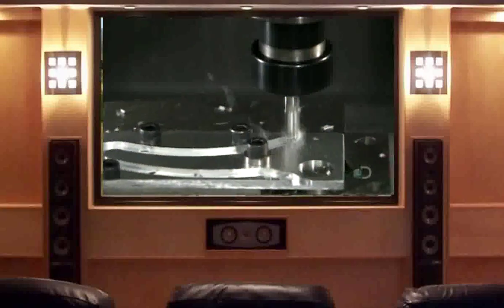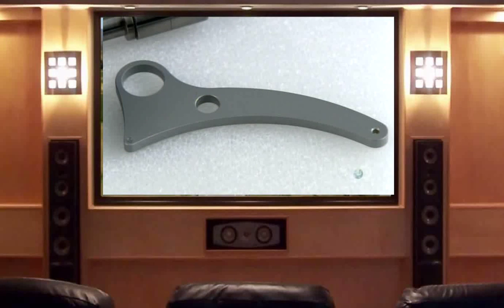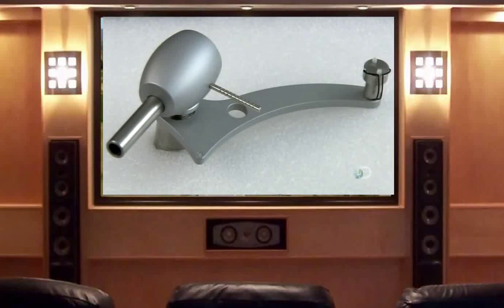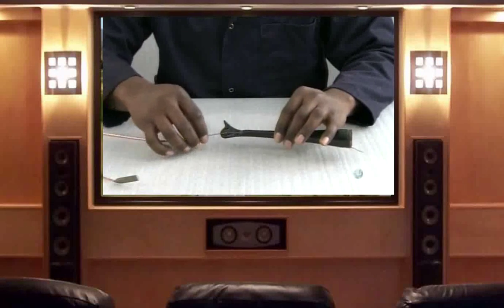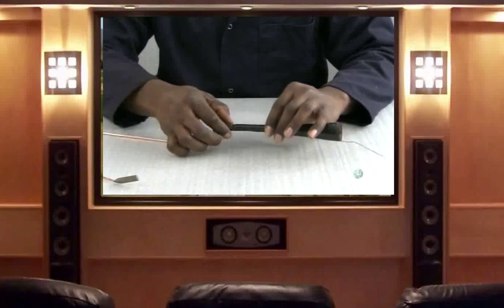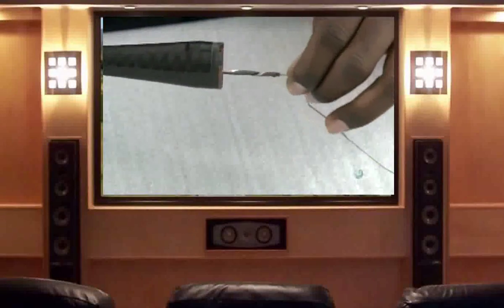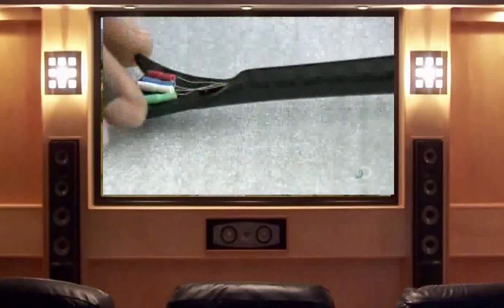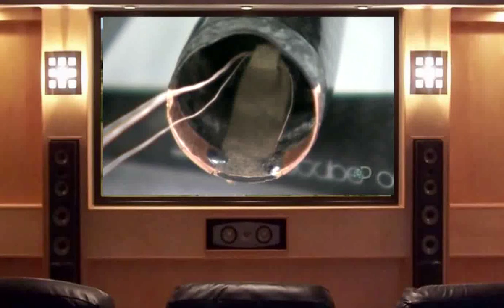Next, the platform for the tonearm takes shape. It's designed to cradle all the parts at the end of the tonearm, including a cylindrical housing for a spring mechanism and an egg-shaped housing containing a bearing. A technician assembles the tonearm, beginning with a tapered tube made of carbon fiber — a high-tech composite that's extremely stiff, so there should be no structural weaknesses in this crucial part. The technician threads a pre-assembled wiring loom through the arm tube, its special wire for high-frequency transfer. These wires have been encased in copper to keep out ambient radiation that would interfere with the tonearm's operation.